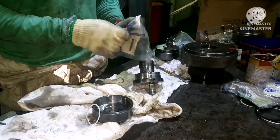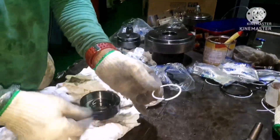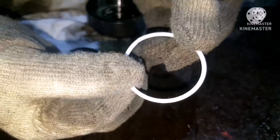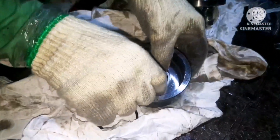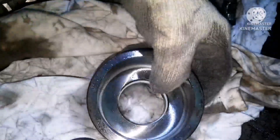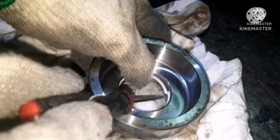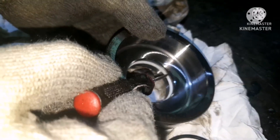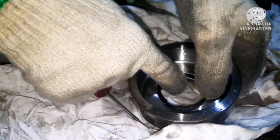These are the backup ring and o-ring. When fixing the backup ring, the face should be correctly oriented — it should be matching in both directions. First fix the backup ring, and when fixing it ensure the taper portion overlaps on top of each other correctly; the Teflon ends should not overlap incorrectly. Ensure the taper portion of both ends goes over each other and does not overlap in the wrong way. Once this is done, fix the o-ring. The cylinder part is done — you can see the backup ring on top and the o-ring below.